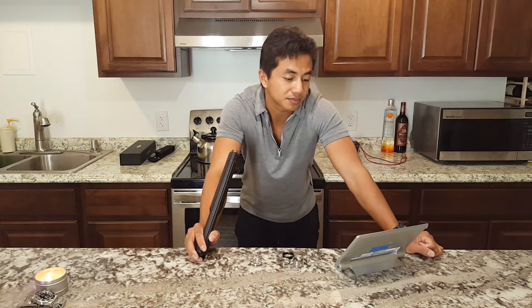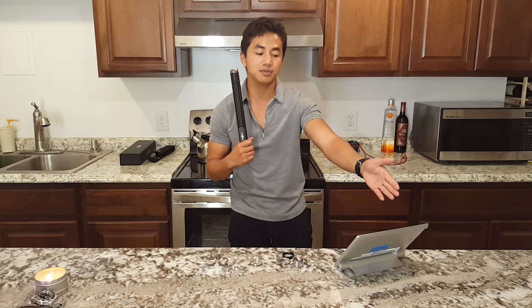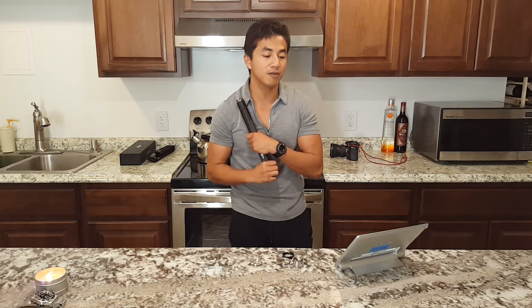There are two variations. The one I have in my hand is the XPL PDT. The version I have on my store is the XPL HiV3, which is the cool white version — the Hi version will be a little less bright. The numbers I gave you previously are for the HiV3; the XPL PDT version is likely 10–15% higher, so if the Hi version is 5,200 lumens, the PDT might be 5,500 lumens. The default will be the HiV3 because cool white is possibly more blinding for security work, but you can request XPL PDT at no extra cost.